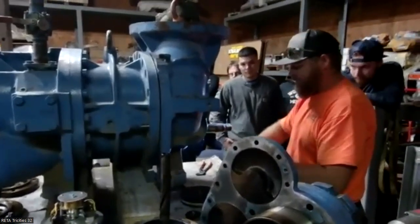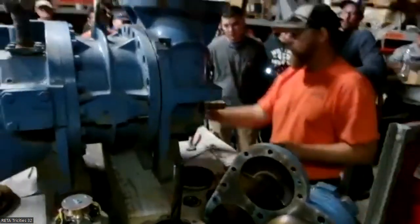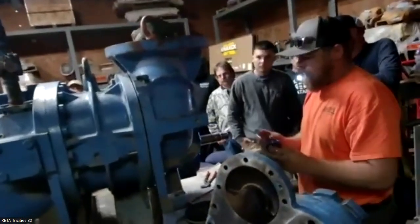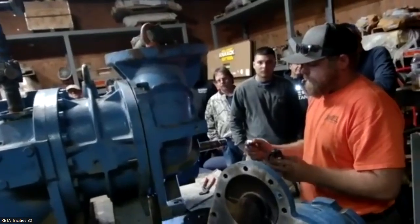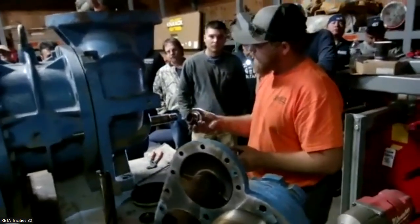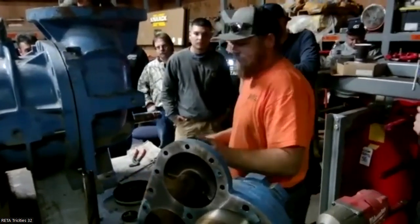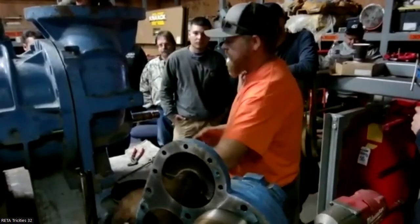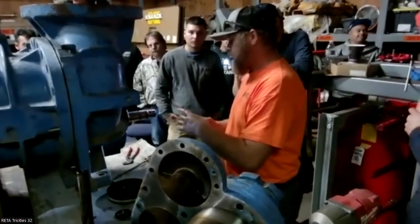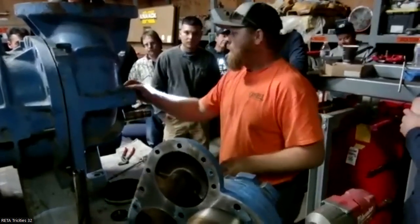On a lot of the older machines, for the oil injection, like the fixed VI that come in here, the oil would pass through there, runs through this rod, and it'll be bigger, and there's only a hole on one side, which has to face that oil injection port. If you put it in wrong, you're gonna have problems. The newer ones, obviously this one's a variable so it doesn't have it, but on the newer ones they actually put holes on both sides, so you can't really mess that up.